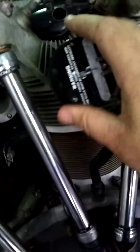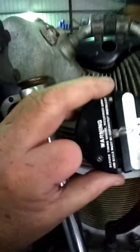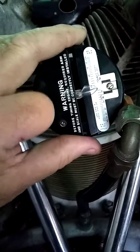For the Pratt & Whitney R985, you make sure you're using the right arm. It says use Arm A, hook end up. You can see this is Arm A - hook end up. I'm going to insert this into the spark plug hole and make sure everything is nice and firm. Then we're going to turn this to make sure our scale runs parallel to the center line of the cylinder.